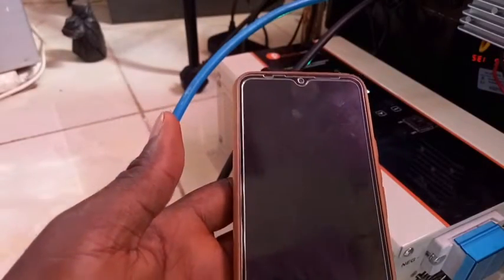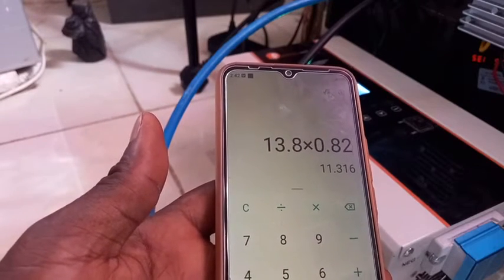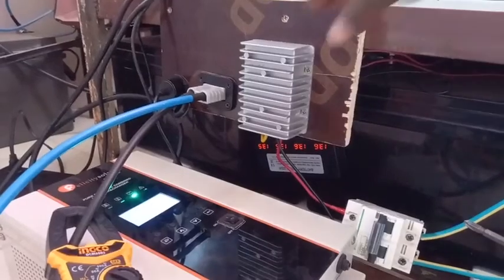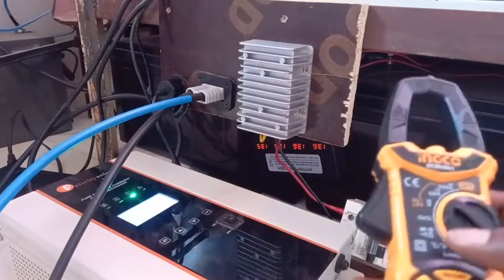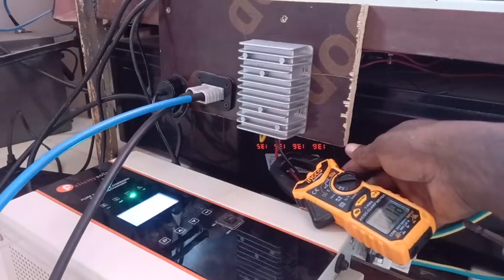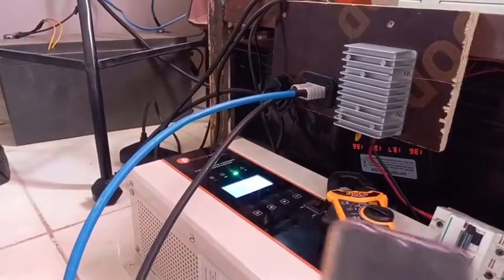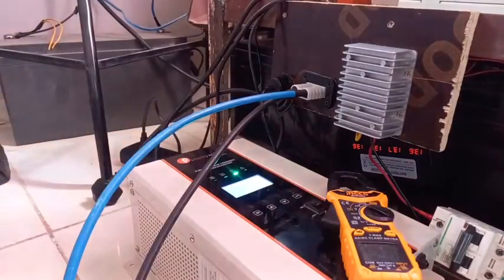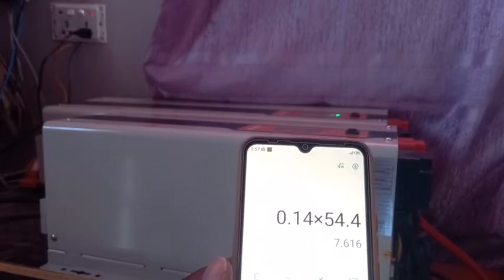Compared to the others — one consuming 52 watts and the other 100 watts — this one is only consuming 11 watts. I think 11 watts is much more reasonable since my highest load will be around 200 watts. This DC-DC converter is capable of 415 watts, so I'll just be running it at around 50% of its capacity. Let's also measure the amperage from the source: I'm drawing 0.14 amps at 54.4 volts. So 0.14 by 54.4 gives about 7.61 watts. Maybe because the current is so low the meter can't measure it accurately, but all in all we're looking at either 11 watts or 7.6 watts from this smaller inverter.